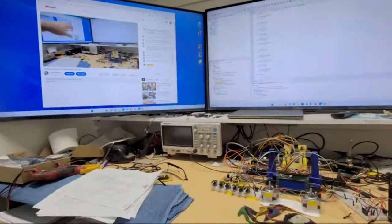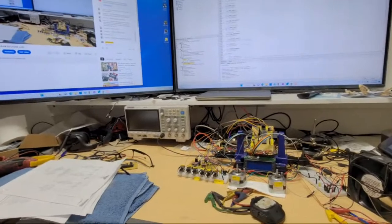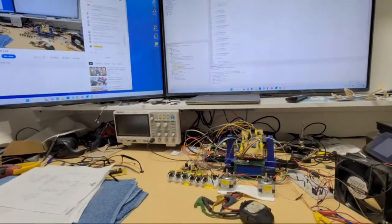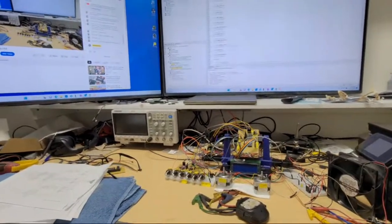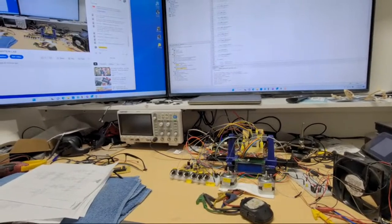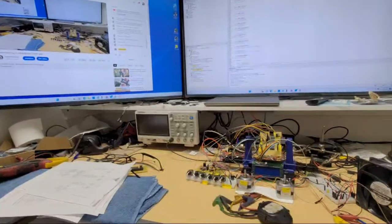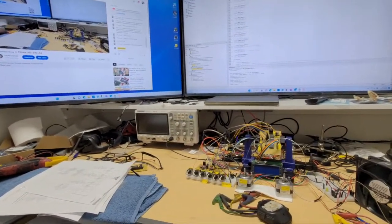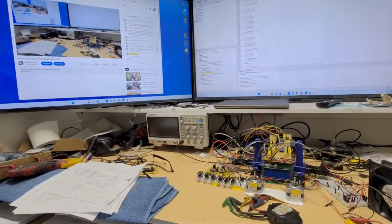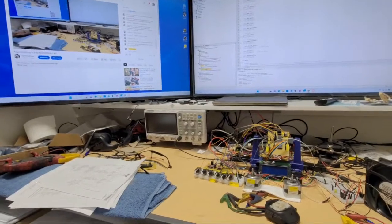Generators are the same way. To make 60 hertz depending on the number of poles, they would either run them at 1800 RPM or 3600 RPM. So the good generators would be a more torquey 4-stroke, like in a motorhome, for quiet. But some of those cheap generators would be 3600 RPM because they have a wimpy motor, so they just have fewer poles and run at 3600 RPM to get your 60 hertz. And then some 2-strokes, same way, man. 3600 RPM, just crazy.